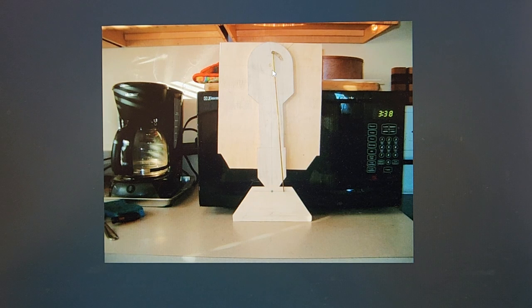At my first droid, I had a big problem with this because the axle in the shoulders that connects one leg to the other — that went through the body — was a three-quarter inch pipe. So you take that pipe's outside diameter, and then where you can safely mount a good beefy mounting point, we were talking about one and a half inches between the central pivot point out. Well, one and a half inches up top had to translate to about three inches down at the foot, and that was a big problem. So the tie rod in the leg was not straight — it had an angle to it.